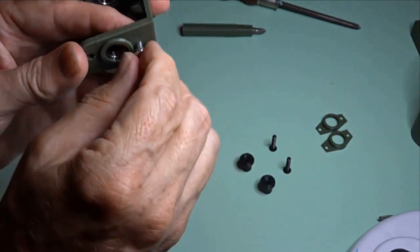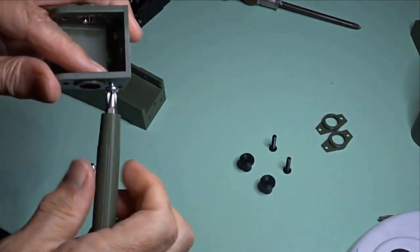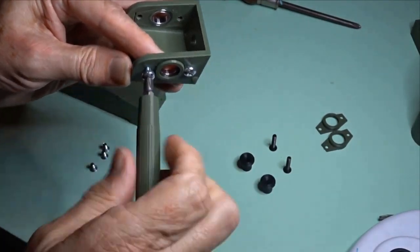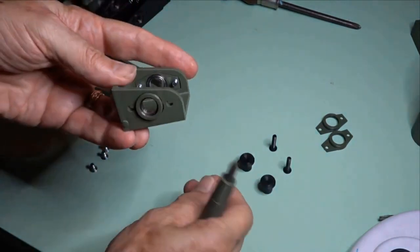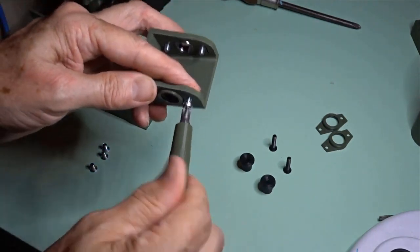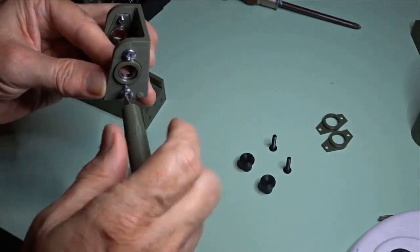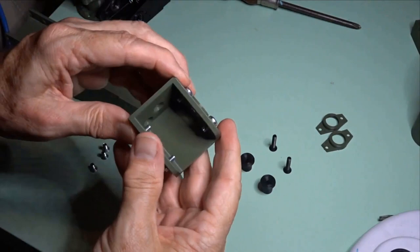But anyway, once they're set up, this is an 8mm M4 button head. And they just go in like that, so they're firm. Don't over tighten, but there we go. So that's the second one. They could be shorter, but these are the ones that are AuthentiKit approved on the existing parts list. So that's what I'm using. Everything in this project is already on the AuthentiKit parts list. Okay. So that's the bearing inserts attached.